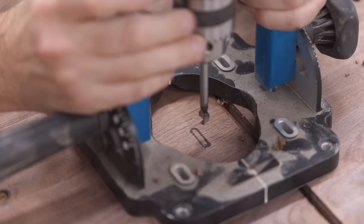As I sand each piece you'll see that I created a jig for the tambour assembly. This jig is important to secure all the pieces tightly and keep everything aligned for the next step, which is gluing on a piece of canvas that holds the tambour together. This is just a cheap painting drop cloth canvas left over from the first time I did tambour doors — the wood glue bonds really well to the canvas and to the wood. After 45 minutes of letting it set up I took the tambour out of the jig and made sure none of the pieces were sticking together. I'm really digging that continuous grain look — it's almost like a big wooden fidget.